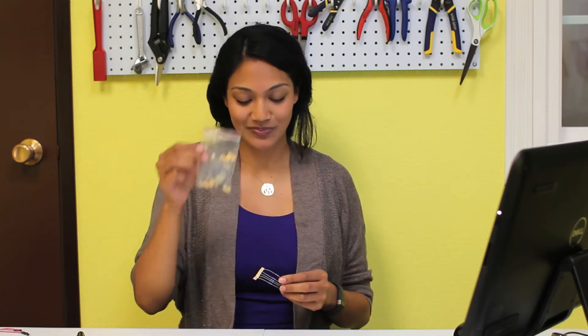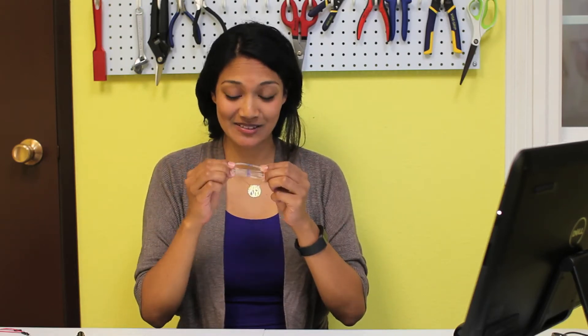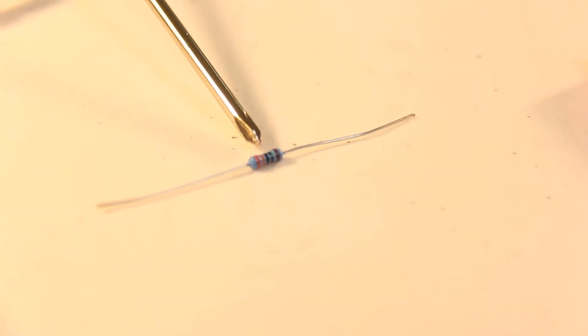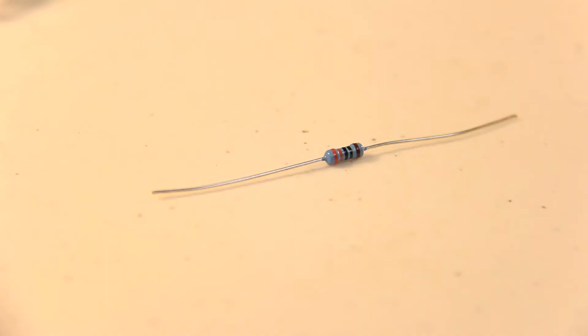To use an LED, we have to keep in mind that LEDs are rated for a certain amount of current. This means we want to utilize something called resistors. You will have a resistor pack — take out your pack of six and pull one out. We'll talk about this 330 ohm resistor. Resistors come in a variety of levels. This one is 330 ohms, and the reason I know that is because it has a color band of orange, orange, black, black, which shows us on a chart that it's equivalent to 330 ohms.